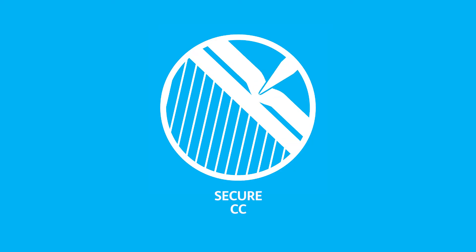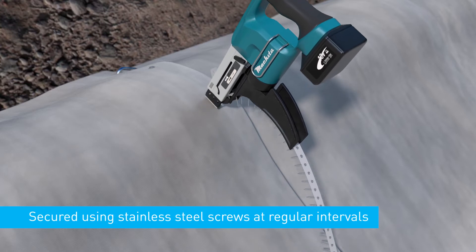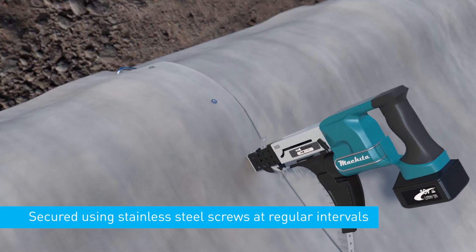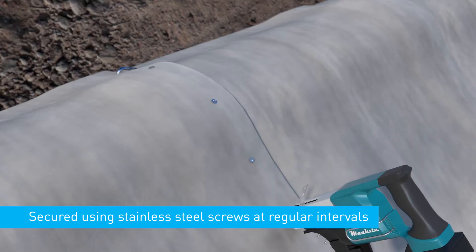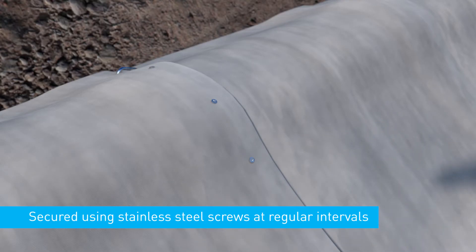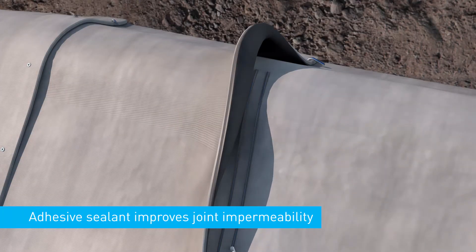Secure the concrete canvas. The concrete canvas must be jointed at every overlap between layers and fixed to the substrate. Overlapped concrete canvas layers should be securely jointed together, typically using stainless steel screws applied with an auto-fed screw gun at regular intervals. Correct screw placement will help ensure intimate contact between concrete canvas layers, prevent washout of the substrate and prevent potential weed growth.